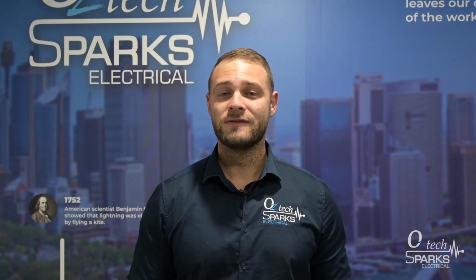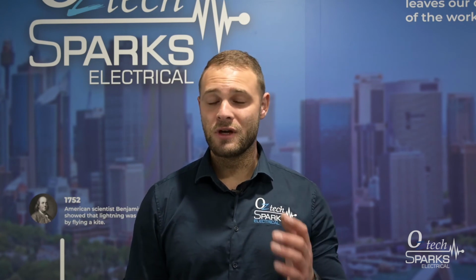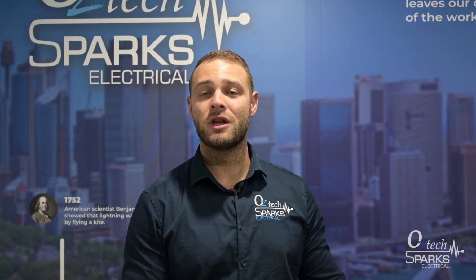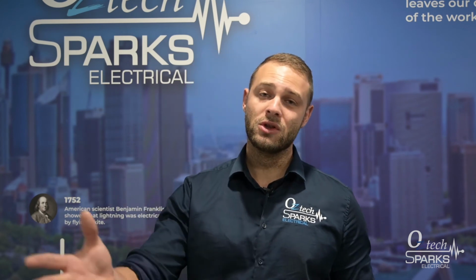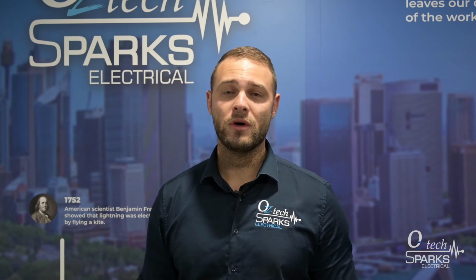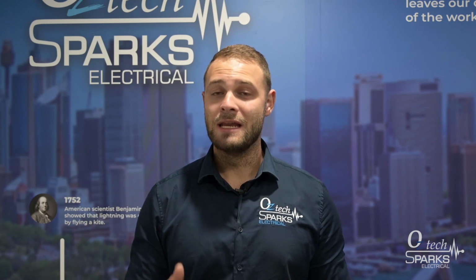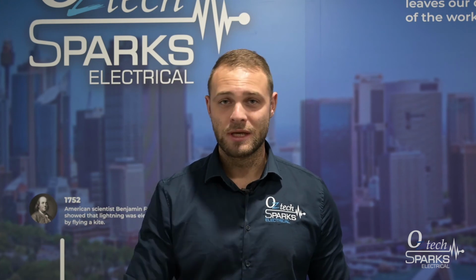Just a useful hint for you guys, circuits cannot be mixed in a house or a commercial space. So if you're going to be installing power points in your property, the electrician is not going to be installing those power points on a lighting circuit, and vice versa. If they're going to be installing lights in your house or your office, they're not going to be installing it on a power circuit. They shouldn't. And if a person was to run a new circuit for a stove or a hot water, it should be dedicated just for that unit. Make sure you keep that in mind.